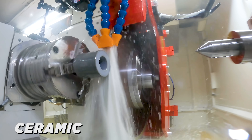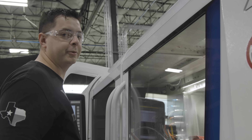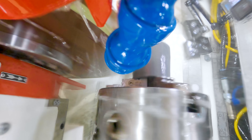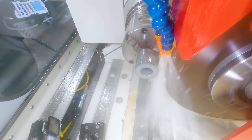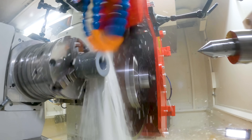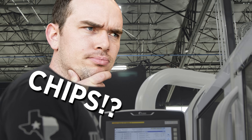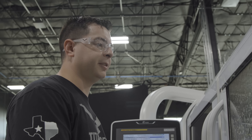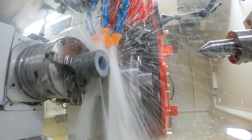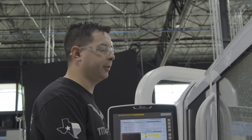Next up, ceramic. Ceramic is a very hard material that's difficult to machine — a lot of the time it gets ground. We just got a piece of ceramic and we're doing a test grind on it to showcase this wheel. You can see since it's tapered, it starts hitting on one side and out the other — that's what we're checking for. We're feeding at 20 inches a minute, really pushing this wheel to its limits. Carbide and ceramic are some of the hardest to grind. We're going to take about 18 thousandths off, but remember there's 10 thousandths worth of taper.